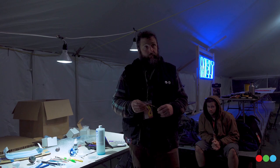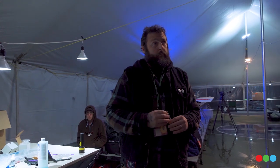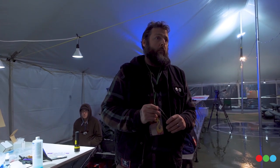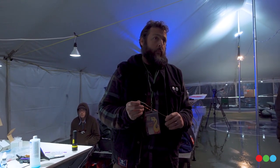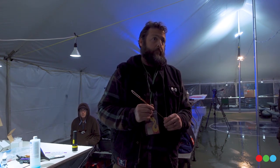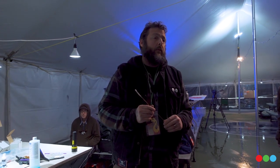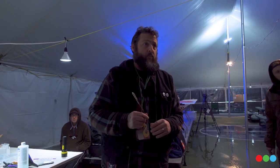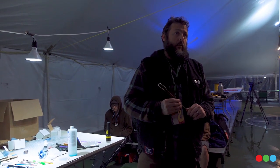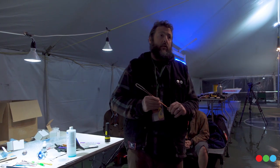Can I say something just for people listening? Titanium doesn't affect your bath, it doesn't dissolve in the bath. I also don't like spending the time drilling the holes in the pipe. So I will buy titanium rod off of eBay, and I will bend that into kind of a half U and then another hook at the top. Then you can slide those pipes down on there and hook them onto your rod. If you're doing bigger stuff, you can drop your whole pipe down in there and dissolve the whole thing, and you don't have that leftover top portion and you don't have to drill the holes.